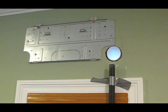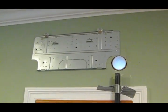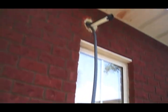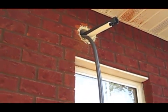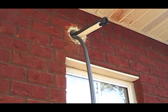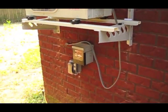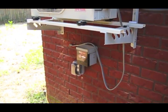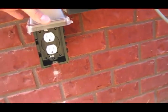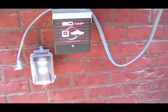The guys are here to do the electrical — got a big hole in the wall. By far the hardest part of the whole project. We got a lot done yesterday. Since this is a 110-volt unit, we came off an inside outlet, drilled through the back of the outlet box, and put in a new weatherproof outlet cover that's built to code. We're going to run the wire along the bottom, get some nice sleeving around it, clamp it to the wall, and hopefully within a couple of hours we'll be cooling it inside.